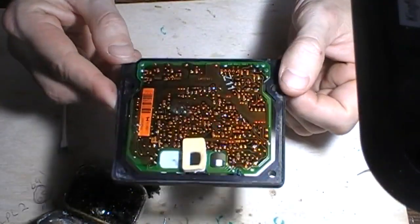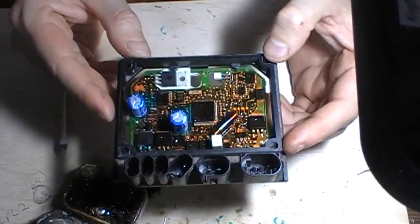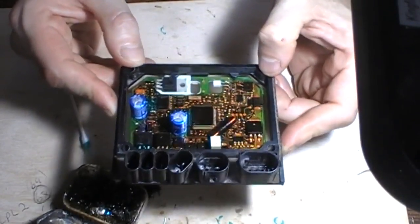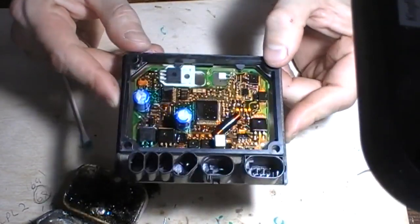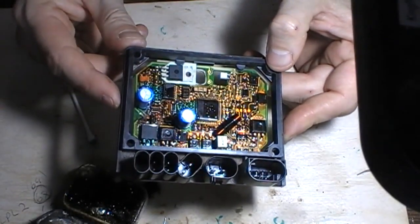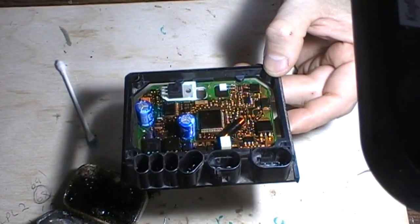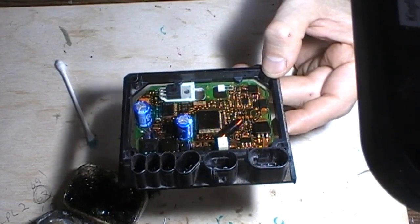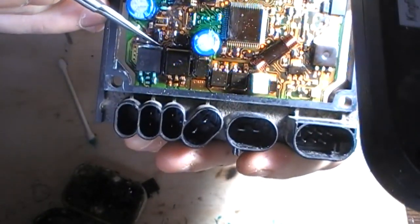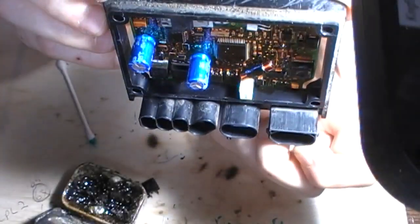These boards are probably the hardiest piece of electronics you'll ever own. You've got to remember, it sits on a heater, it gets up to 90 Celsius every single time. It is moisture ingress, vibration all the time off a vehicle. It's pretty much the hardest piece of electronics you'll ever own. So for that reason, certain parts have to be repaired in a slightly different manner than, say, repairing your TV or something, like an indoor piece of equipment. Just the example there of adding the extra little bit of solder on the fillet. Not required on anything else, but something that's high vibration, things like that, absolutely.